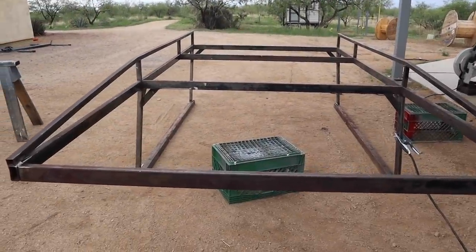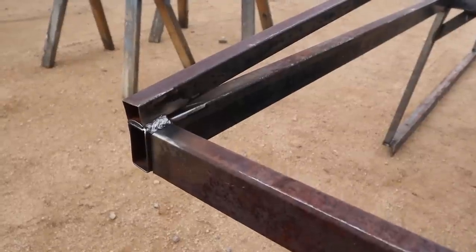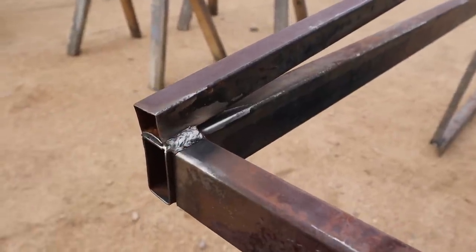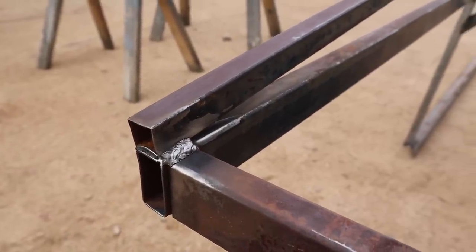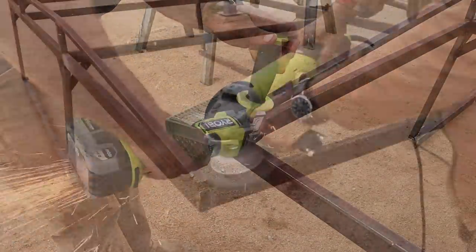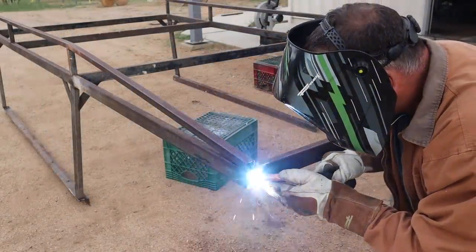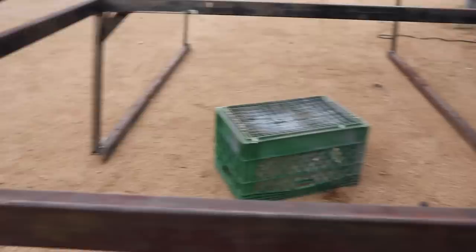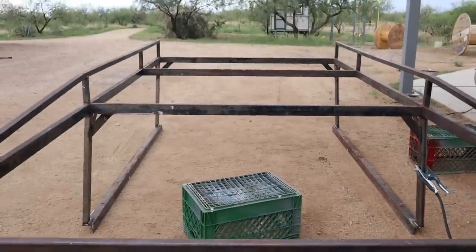I'm just about finished and it'll be ready for paint and primer, but I noticed one thing on the existing construction. This weld right here - not mine, from when it was originally built - has a small crack that starts here and goes along the side of that weld. So I'm going to get the angle grinder, cut a score line there to allow some space for my weld to penetrate, and repair it. It's definitely not the prettiest weld but it is better than it was before. I'm going to do the other side too, then prime and paint this and it'll be done.